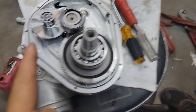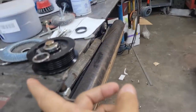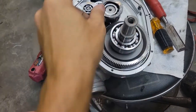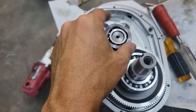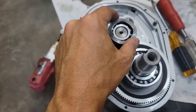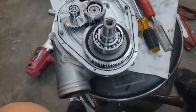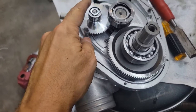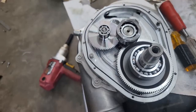Here's the inside of your cover and the inside of the ProCharger. You've got these washers and your bolt that hold the pulley on - those bolt into this. Be very careful that you don't lose either one of these bearing retainers - those need to stay right where they're at. If you need to reclock it, this is where you'll be doing it. We've got two o'clock, 12 o'clock, and 10 o'clock positions.